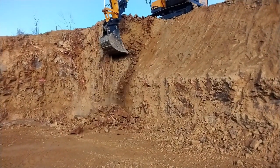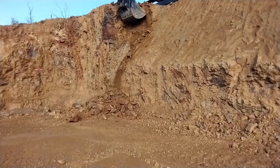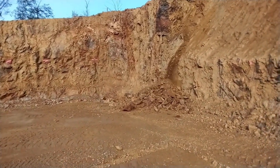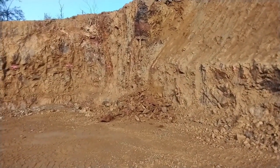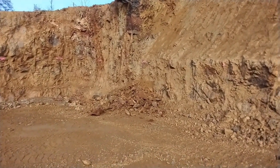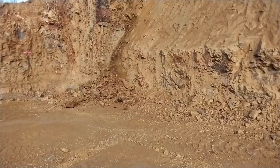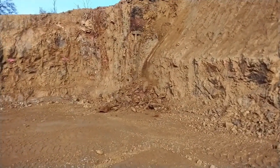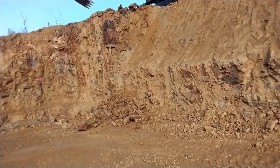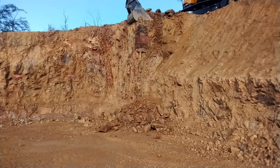I've got my helper cutting the slope. At this point it's just a question of connecting the upper and lower marks - the lower marks are laid out, they are the catch point of where the one-to-one slope begins. The upper marks on the bank from earlier are laid out, so he can't see the lower marks, but he uses the adjacent slope as a gauge and I guide him if he's off a little bit. He's actually pretty good at this - some people have an eye for grades, levels, and elevations, and some people don't, but he can. So I let him do it.